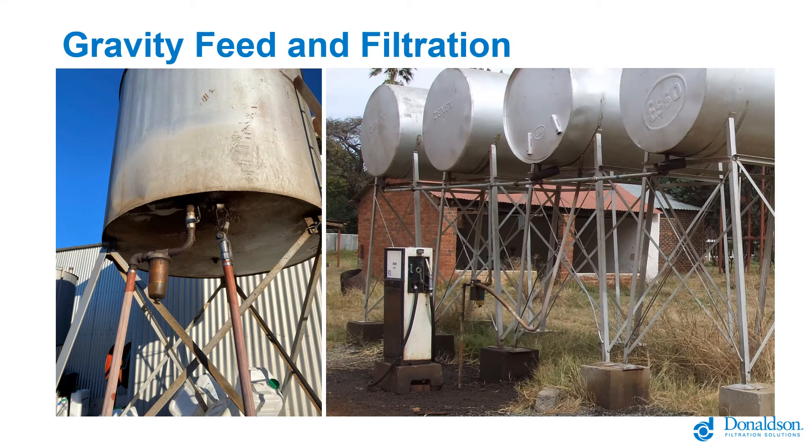Something to touch on right away with small diesel applications is gravity filtration. Gravity filtration has been around for a long time and poses a challenge for people operating modern high-pressure common rail equipped equipment. The fuel filtration required for these modern engines is significantly tighter, and in a gravity situation you only have a couple of pounds of pressure to push fluid through a filter, resulting in very short filter life if you do significant levels of filtration. You can see on both of these systems there is a filter in place — those are typically a screen or perhaps a water separator, both of which are very coarse filtration. The type of particulate in fuel is very small and will typically go right through these filters.